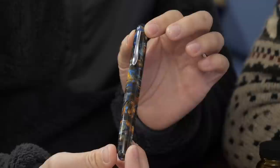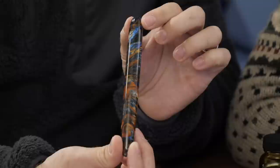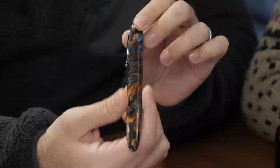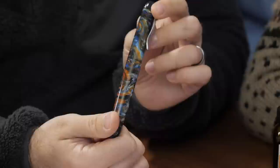This material is rather incredible. It's called Alumilite — a specific type of resin, different from your typical acrylic acetate. It's still cast and turned, similar kind of process, but the resin component itself is more like an epoxy resin. It's extremely durable, very hard to polish, but once it polishes it gets a great shine and holds up really well over time. The polish lasts longer — you're not going to get as fine scratches. It's very durable and more impact resistant, so it's just a more durable pen overall.